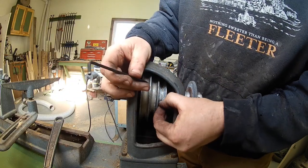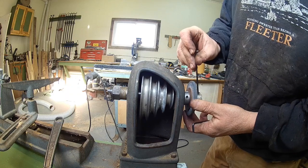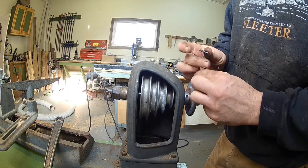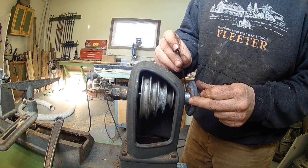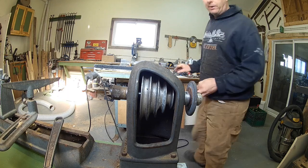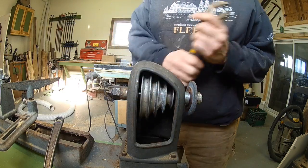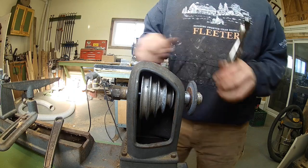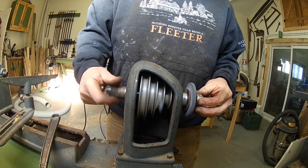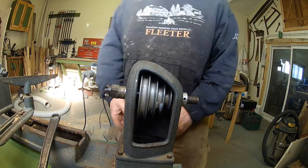Just a simple set screw — this one has one set screw in each collar; you don't need a ton of force to hold it on. Undo these and get them out of the way. The key thing to remember: this is actually a left-handed thread, so it feels like you're tightening it when you're loosening it. I use channel locks because I don't want to get too many slivers.